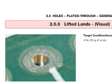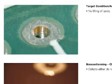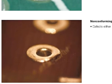We have another paragraph in IPC-600 which also shows that the target condition is no lift. There's an indication that if it is ripped up where there isn't any solder exposure or thermal stress, it's not acceptable. So the member says: I've got solder — maybe that's the same as a rework simulation or solder float. What does IPC have to say on that?